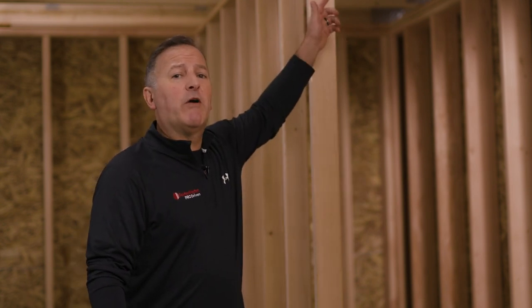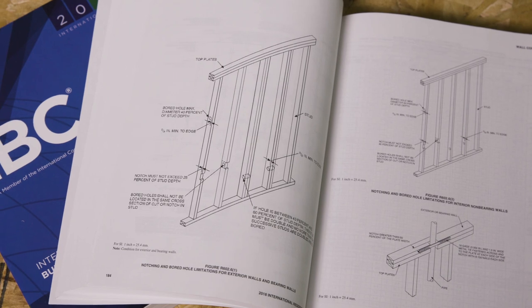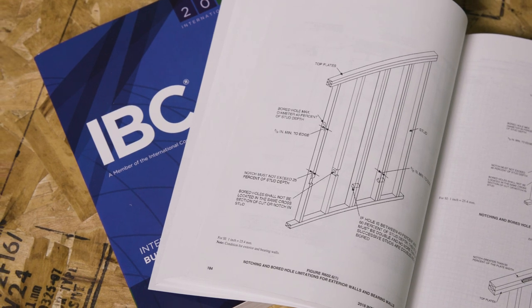For this reason, it's very important to leave a gap between the top of the wall and the load-bearing elements above it. But the top of the wall must still be restrained against lateral movement and vibration. By code, a structural connection capable of holding 5 pounds per square foot of wall area must still be made.